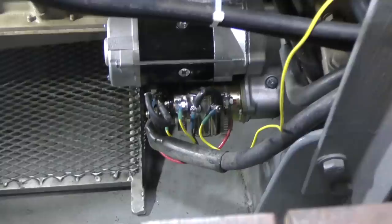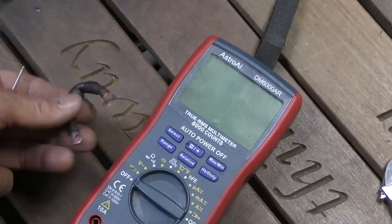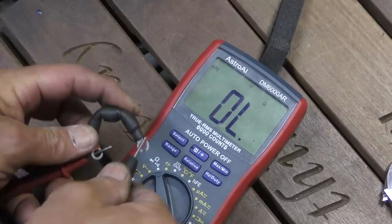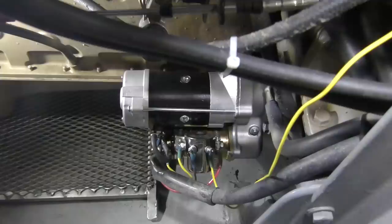That didn't last long - that diode. I smoked it already. I got like six or eight trial starts and that was enough. It burned out - fail closed - so I'll take it out and see what happened. To test this, set it to ohms and also diode mode - see that little diode symbol. It should let current through in one direction. Nope - it doesn't. It would show a little bit of resistance. Turn it around to make sure I don't have it backwards. Nah, it is dead - it is an open wire.